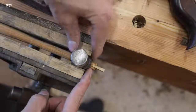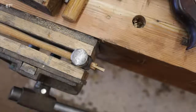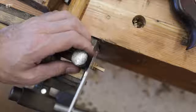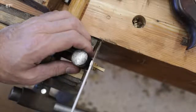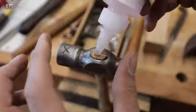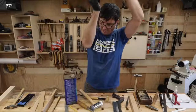From this perspective you can see the handle is sticking out about half an inch. Look at the flare — look at how much that's mushroomed out. That's going to be nice and tight and hold for a long time. The Swell Lock also seems to keep the wedge and everything intact. Some people like to cut them flush; I don't — I like to leave about an eighth of an inch. I think aesthetically it looks nice and makes for a stronger bond. After trimming, put your Swell Lock in there and keep adding until it just won't take anymore.